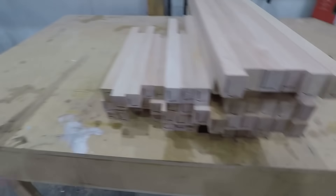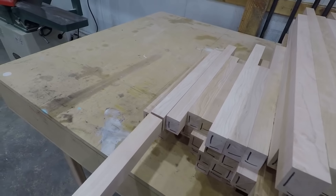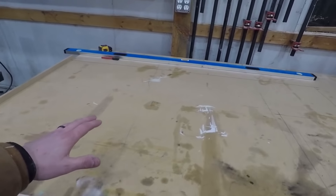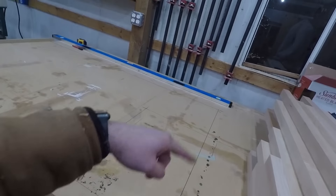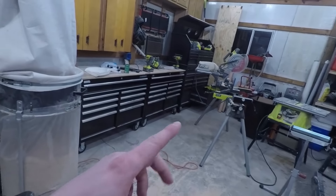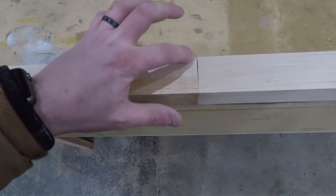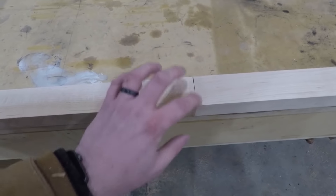I'm just going to start laying it out on this table and I'll show you how I cut where they meet up end to end. I have the size of the table laid out by these black lines right here — it's two inches bigger width-wise than what I need and an inch bigger the other way. We're going to start laying them out and I'm going to cut them on my miter saw. I've got these two pieces that are going to make up the front, and they have to butt together with no gap, which is pretty tricky because the miter saw is made for framing a house, not for making these precise cuts.